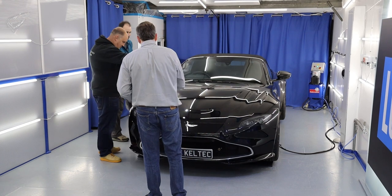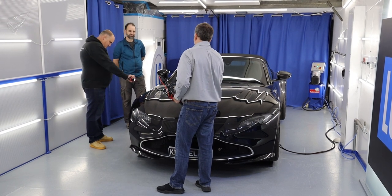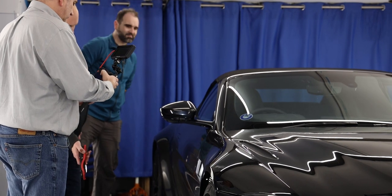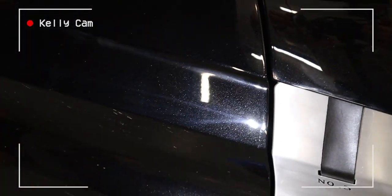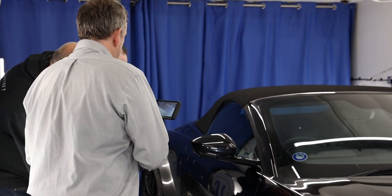Let me turn the camera on so I can see the screen. We've got the classic rotary buffer lines — even with the light. I can zoom in: you can see clearly it's factory buffer lines. There's also what could be sanding marks. I wiped that spot and it didn't come away, so I believe that is actually sanding marks from the factory. Have a go at capturing that with the small camera while I grab a cloth and IPA to confirm.